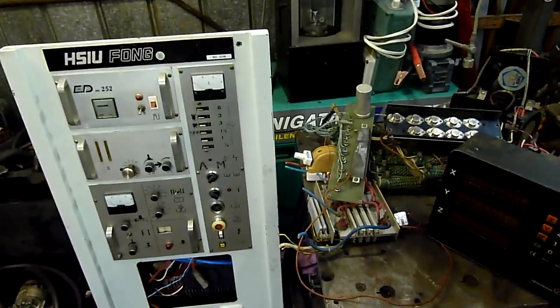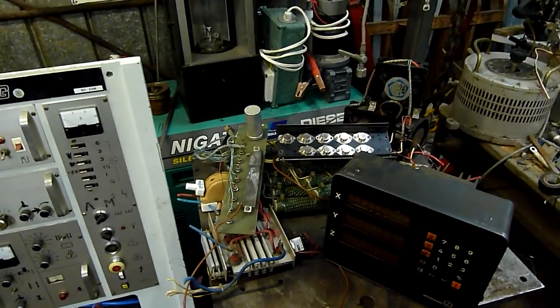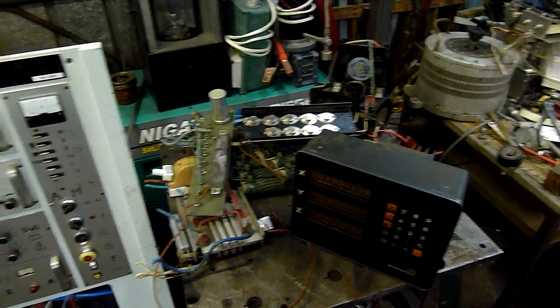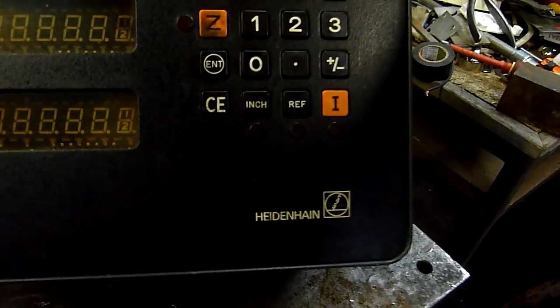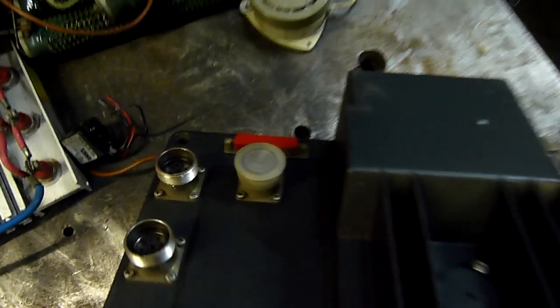Okay, next is EDM stuff. I'm also getting the sliding table and headstock assembly to modify - probably into some kind of improvised drill press with X and Y axis controls. It's also got the scales for the DRO mounted on it, which makes things very easy to dial in. It's a fairly expensive DRO - Heidenhain actually, West Germany. Fairly expensive stuff, it's even got an RS232 port on it.